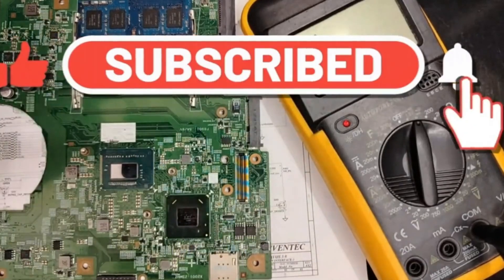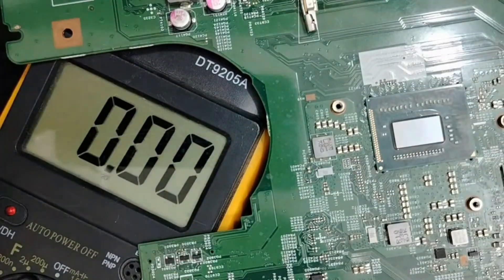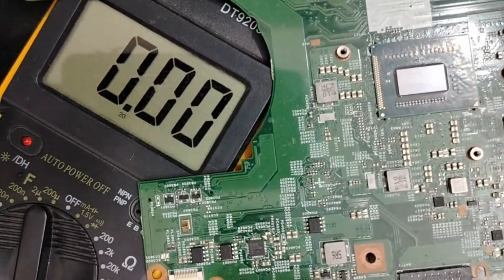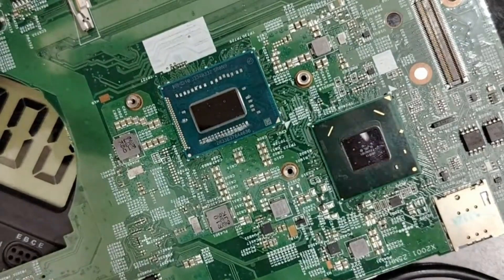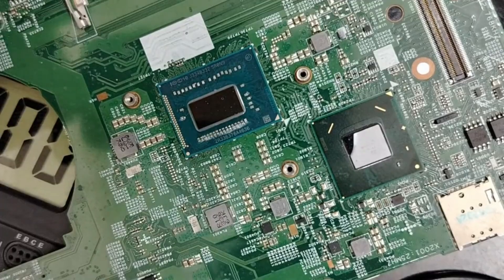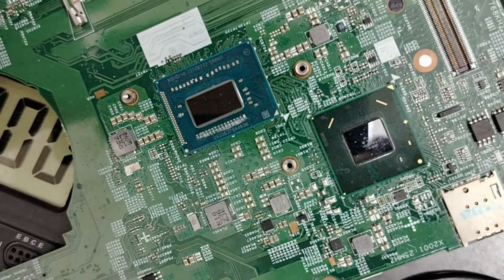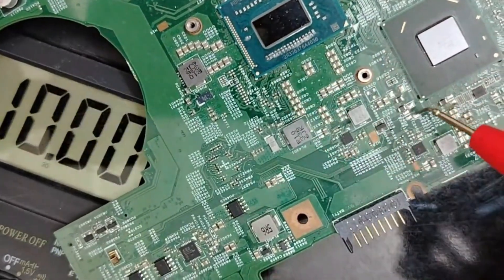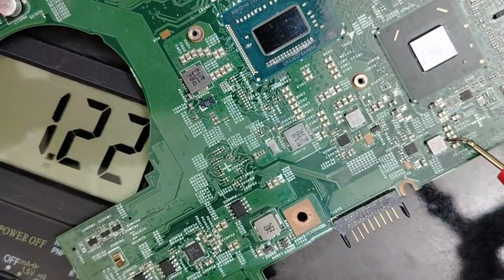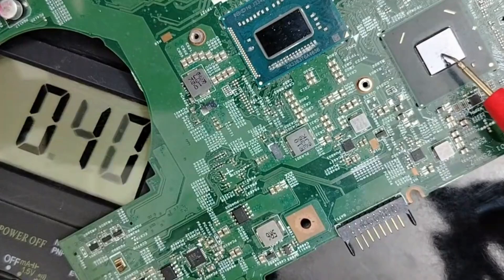Now guys, I will prove what I'm saying. I will begin from zero to the end and use the process from beginning to end. So you get, for example, a no-data motherboard — a motherboard with a fast fan spin for about five seconds, or maybe three seconds, and then it stops. You check all voltages and find all voltages are present except one — for example, except 1.2 volt for the PCH. If the PCH is not powered, you will not get anything on the screen.